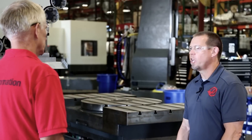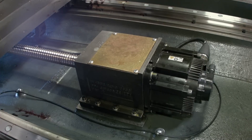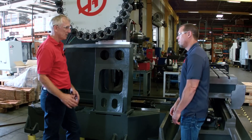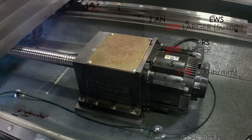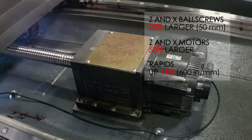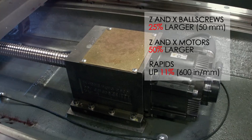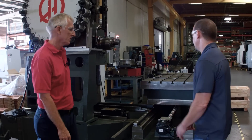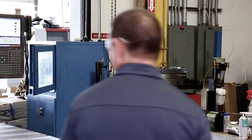Standing here talking about the tool changer, I keep getting distracted by this — you guys changed the ball screw diameter and the motors, didn't you? Right, by reshaping the base we could put a much bigger and faster ball screw in, and that requires of course a bigger motor to make the machine faster. Okay, but it's not just because of the motor, right? We actually redesigned the column completely. We got a lot of mass out of the column, which allows us to move faster under more control.